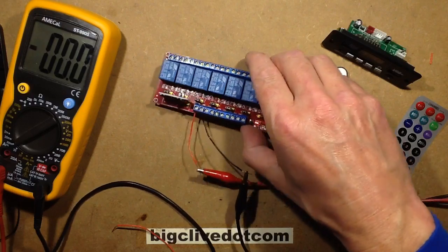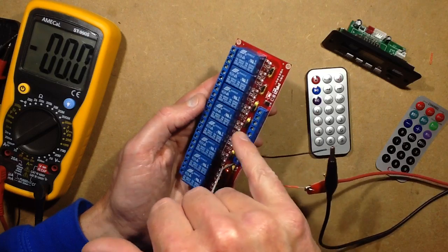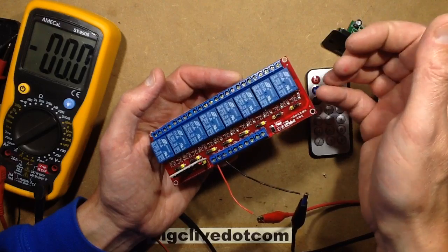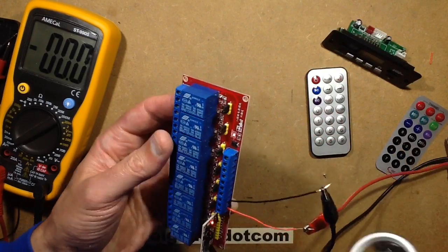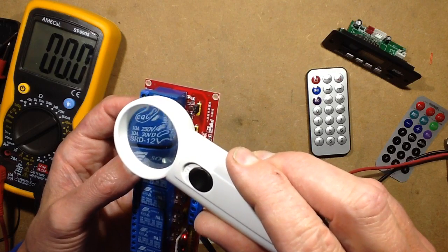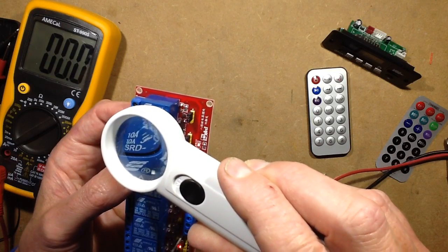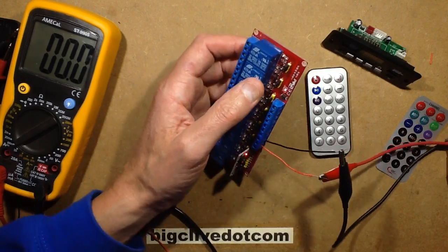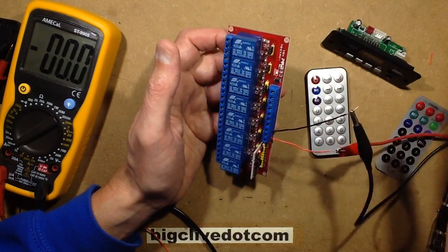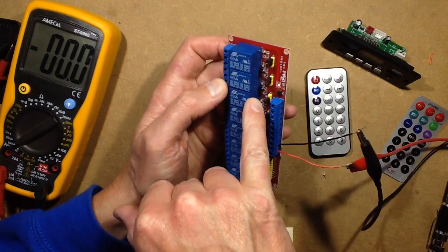And there's a strange little chip. It's a 6-pin chip, and I thought, are they using some tiny little surface mount opto-isolator? But it appears to be a chip that's designed for allowing, I don't know what it is, the numbers on it are just 46, and then at a completely different angle is 2 dots and C. I don't know what that is. I don't know if it's some sort of multiple polarity logic input gate driver. There's no other transistor. That little tiny 6-pin chip is driving the relay.